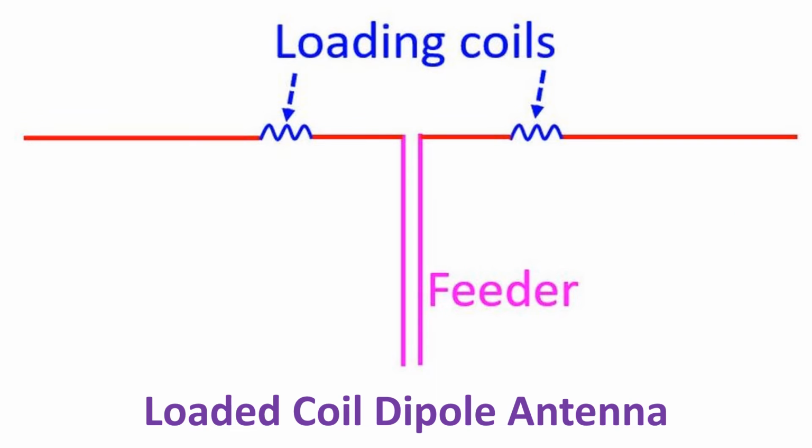Another peculiarity which I noted was that after changing the cable, the SWR dropped to 1:1 at the upper end of the band, while it became 1.4:1 at the lower end of the band. Power output shown on the meter was much better after the change of the cable. I could not believe that the improvement in performance was solely due to the decrease in length of the cable, reducing loss in the cable.